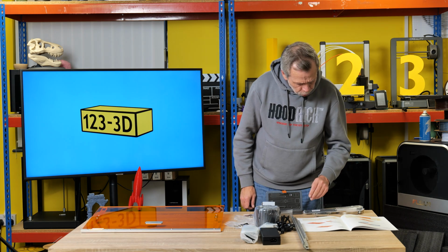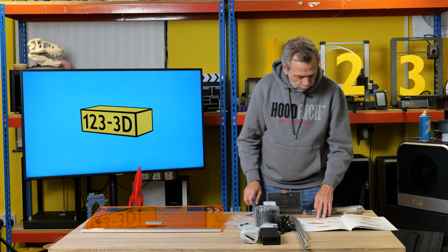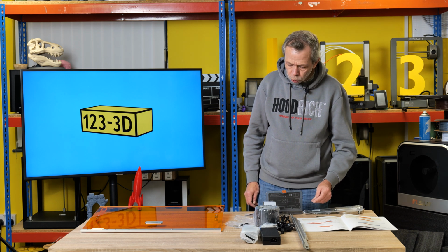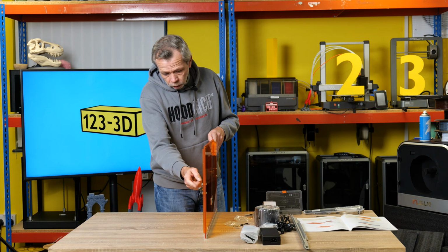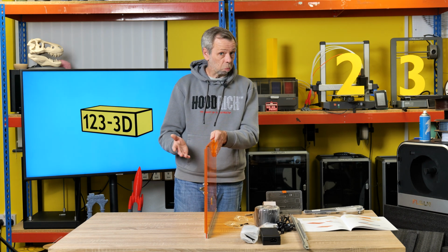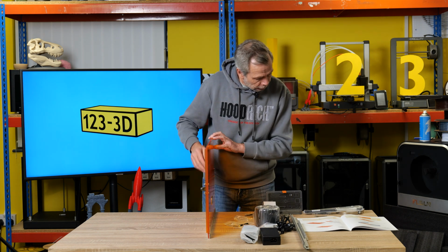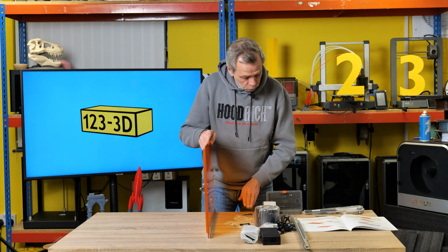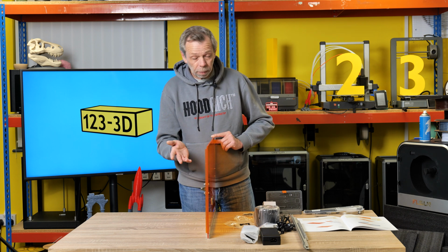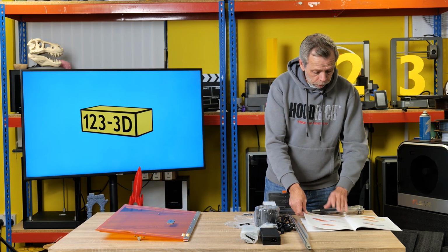Now there's a bit of a discrepancy here, because it does say, pay attention to the direction of the anti-slip nut, the anti-slip split nut. Honestly, in my opinion, these are nylock nuts. They're not anti-slip split nuts. So the image that is showing you in that reference picture is not actually what you have. Ultimately, they are nylock nuts. The bigger portion with the hex part goes to the plate, the same as any nylock nut. So that's just something that, if you're not quite aware, may confuse you a little bit, but that is what it is.